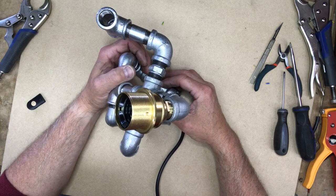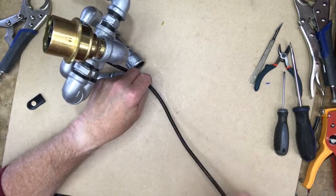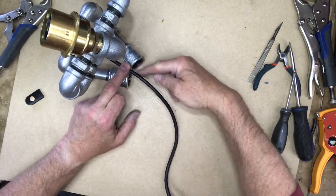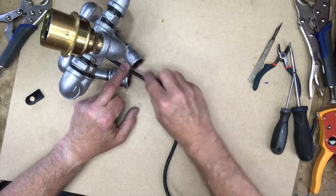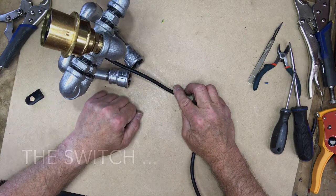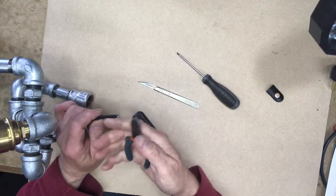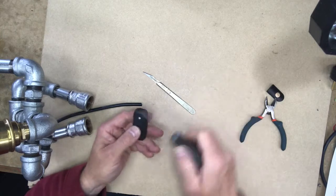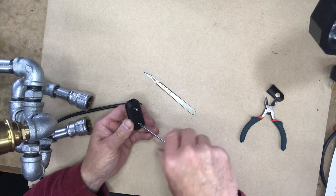All that's left to do now is to put the switch on and wire up the plug. Your switch can go anywhere along your cable, but I'd advise it to be at least four inches — ten centimetres — away from his feet, because you need a bit of room to manoeuvre. Let's get the switch wired in. As you can see I've cut the cable about four inches from the feet of Pipe Man using wire cutters. Let's undo the switch so you can see what you're dealing with — we've chosen a very simple one-pole switch, just a simple off and on.